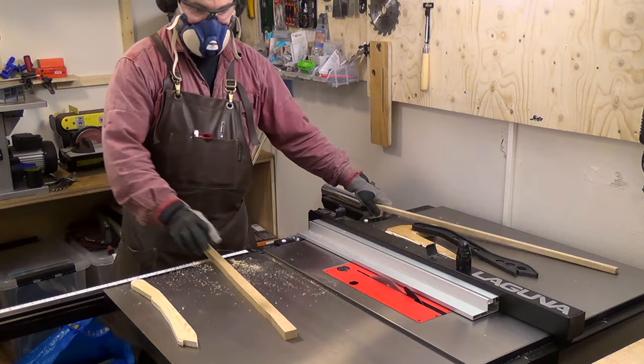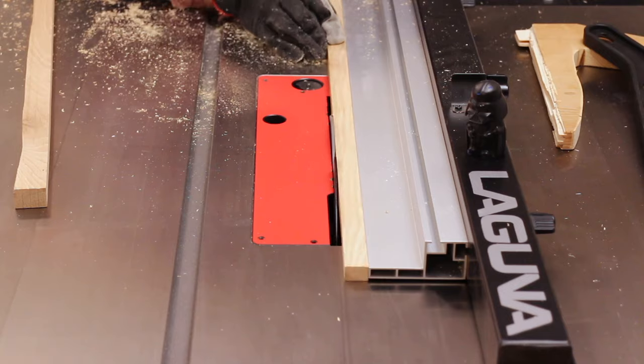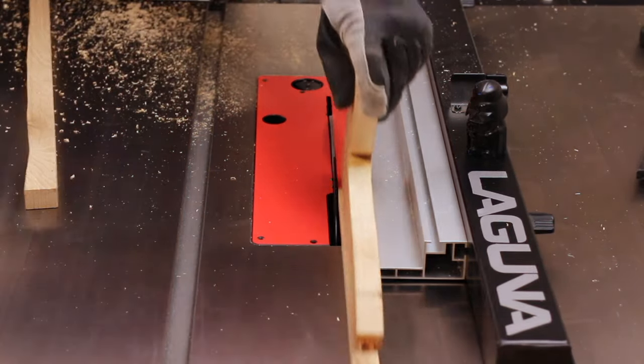I have my Laguna Fusion 3 on a slow 16 amp breaker, but the shop vac on a normal 16 amp along with the rest of the equipment in the shop. Baby Vader said that would work out fine. As you can see here, the saw is still running. After this incident, I put the shop vacs on the same breaker as the saw.